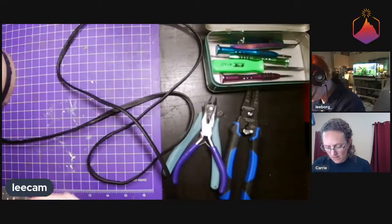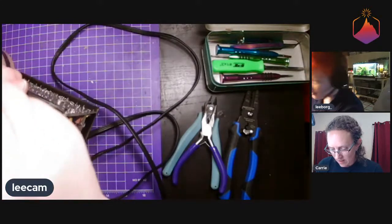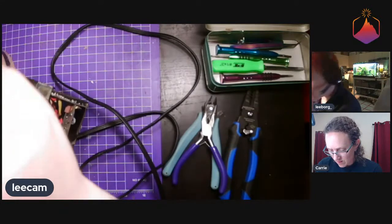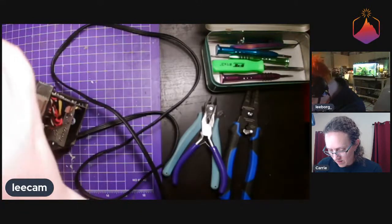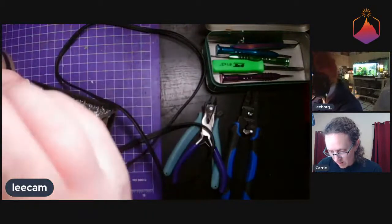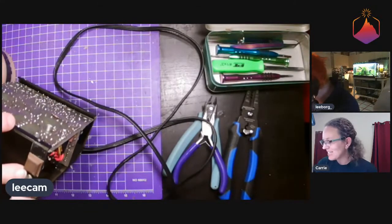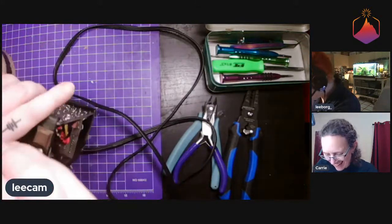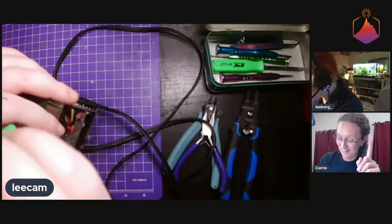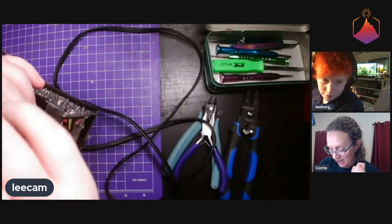Let's see, FG085 manual. Let's see what it says to us. Power switch. Looking for specifications here. Aha, frequency range. It says it goes up to 999.99999 kilohertz, but in spite of that, no limited range is set for frequency entry. It should be noted that there are practical ranges for output frequency due to the low resolution 8-bit DAC and slow sample rate.